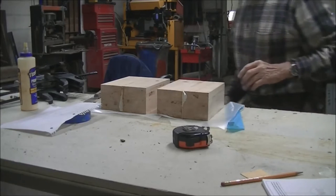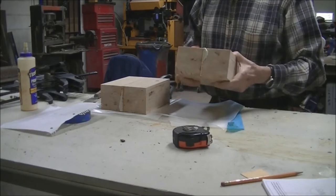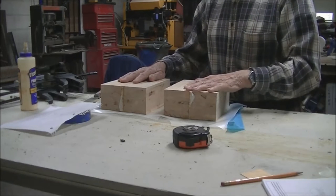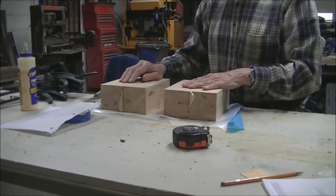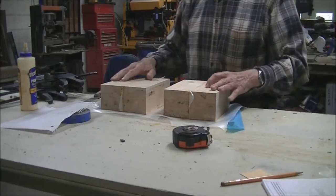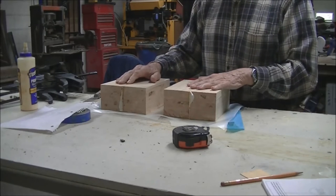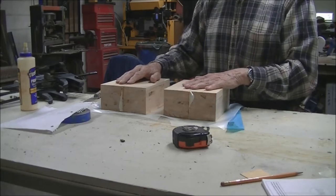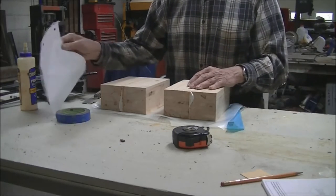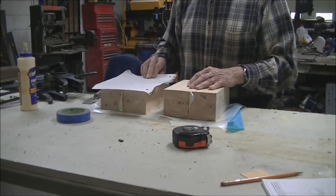I've already planed them and I've put the two halves together with paper in between, and now I'm going to join this half to this half. After it sets up overnight — I always like for them to set up overnight — I'll put them on the lathe tomorrow. When you glue these together with paper in between, I strongly suggest you do not use newspaper. I used it one time and had one hell of a time getting them apart. Newspaper soaks up the glue and you end up with a bond. I generally just use a piece of paper out of a notebook, or brown paper.